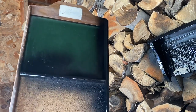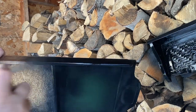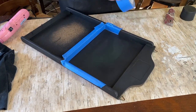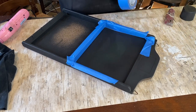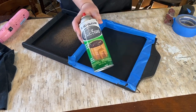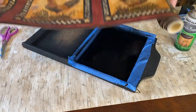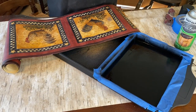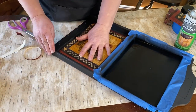I decided to use spray paint because it had so many corners and different angles and edges. So I spray painted it and it came out really nice. Now I'm taping off the chalkboard because it was green and I wanted to put a fresh coat of black chalkboard paint on it. I have my chalkboard spray paint and I'm doing a thin coat — I did two coats. You don't want to do a thick coat; you want to do thin coats each time. I only did two because it was a chalkboard before — if it had never been a chalkboard I may have done more coats.